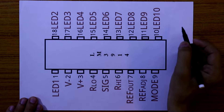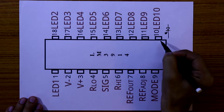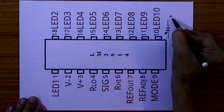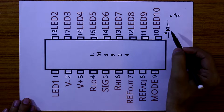It means you have to connect the LEDs in this way. The negative pin will be connected to the output pin, and the positive pin of the LED will be connected to the plus VCC. And there is no need to connect any series resistor with this.